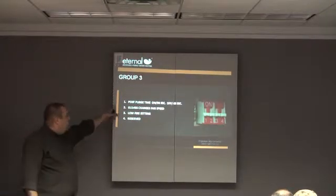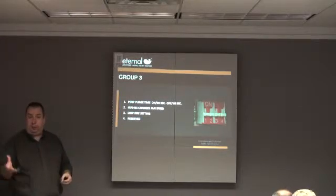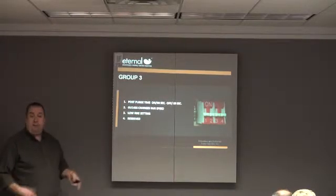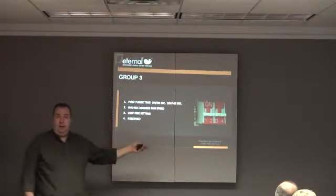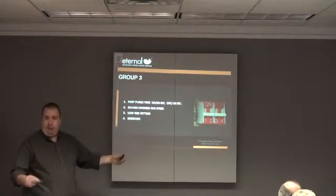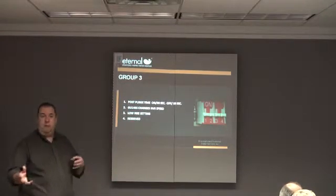And the last one, number 1 is your post-purge. It'll always be on. Number 1 means that you have a 90-second post-purge at a low RPM. If you shut it off, you'd have a 60-second post-purge at a higher RPM. We'll do that on some commercial applications, or some bigger houses applications, because the tank will not recover itself until the post-purge is done. So sometimes you want that lower post-purge.